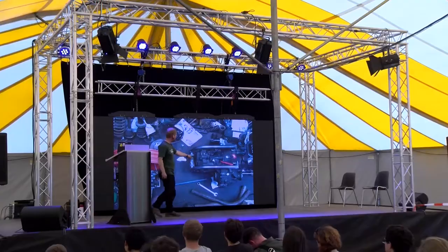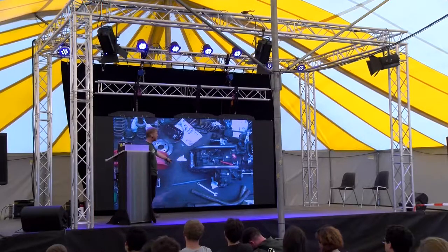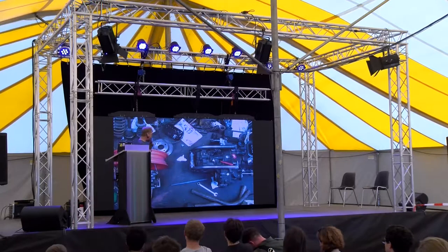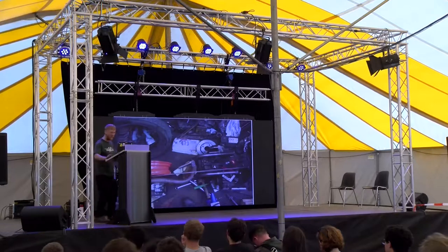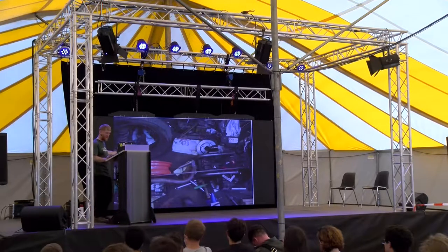And then I had to move on to the actual swinging arm. So again, some much thicker tube, because it's not on both sides. That's 50 millimeter tube with a 5 millimeter wall thickness, really quite chunky. And luckily my little hydraulic press was able to bend it round. Again, it was an operation because you can't make jigs really. It's not the sort of thing I'd ever 3D model and then try and make. So it started off with a long bit of bar, bending it and offering it up and taking it away and bending it, until I had these two rather cute bends and curves, which were then welded into place to have a rear swinging arm that curled around to allow space for the tire on it, and of course support the bevel drive, which is the next part.